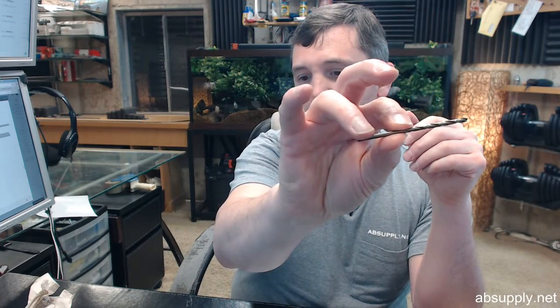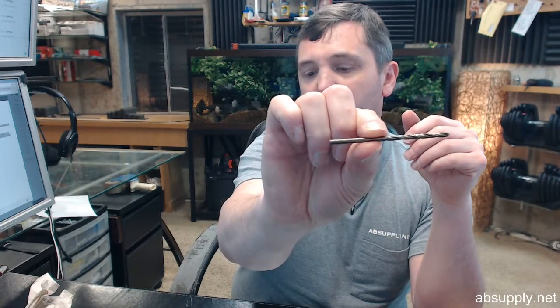Not so much on an 1/8 of an inch, that bit will just crack, which you don't want to do. But on a 1/2 inch size, you could be in a position where it's dangerous to drill. So I prefer the 135-degree chisel point. This is an 1/8 of an inch, 1 5/8 flute length, 2 3/4 overall length in cobalt.